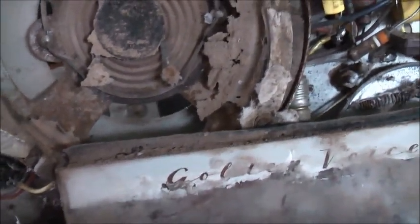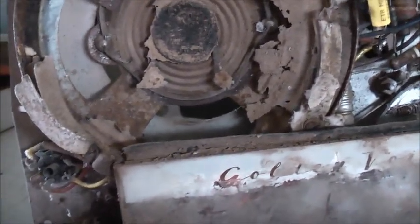No red plating on the valve. If the speaker was disconnected or open, it can red plate the audio output valve, so it's not good to do that. The closest matching impedance speaker I've got is 4 ohms, so I'll deal with a 4 ohm speaker but I'll be very careful.